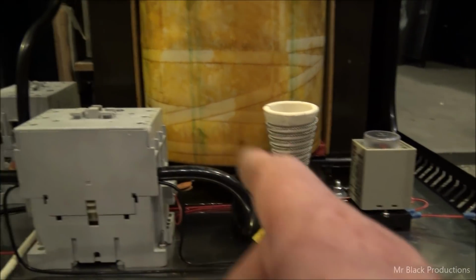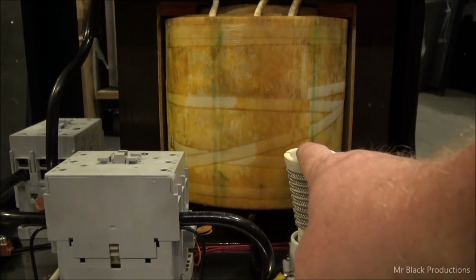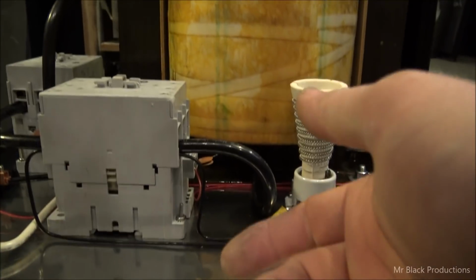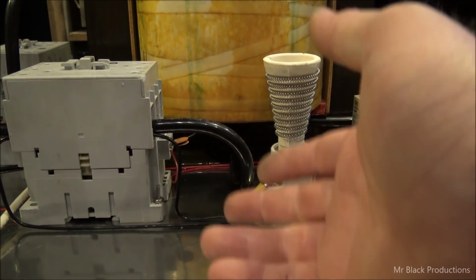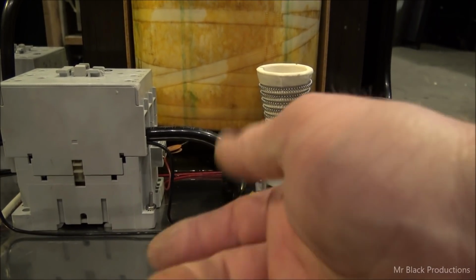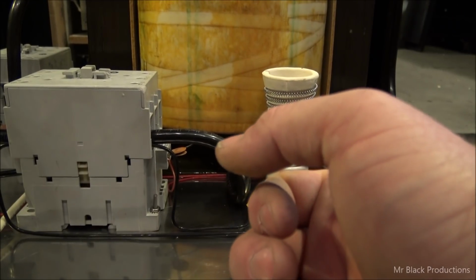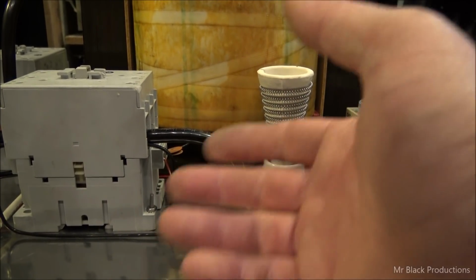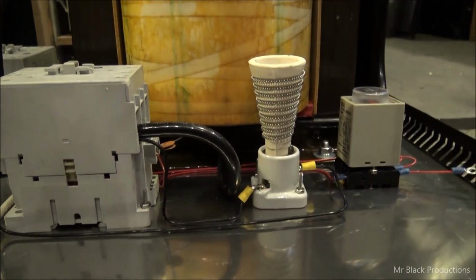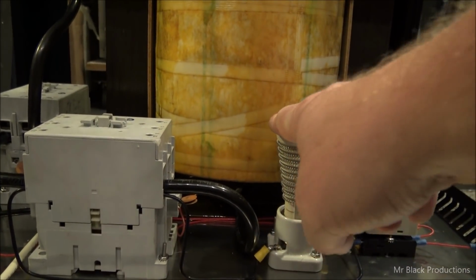So what we discovered very quickly with Vader was that if I didn't give it a 4 or 5 second period for this coil to be working and letting through one electron at a time, there's more than that, of course. I'm being sarcastic. We're thinking about our marble analogy. Throwing one BB or one marble at a time into the bucket to start filling the bucket up, it sees it as a dead short, blows up your rectifier pack, and on and on and on. You have problems.